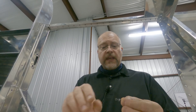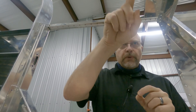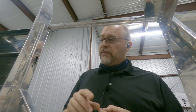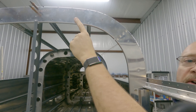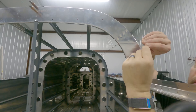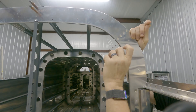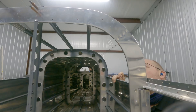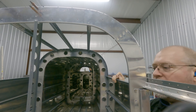That last little bit wasn't bad. I took these K1000-08 nut plates and put them in — there are four on one side and then one in the back. Those look great. Now it's a matter of doing the rest of the work, which is attaching the back. All these little holes you see each need a nut plate — I have to first attach the nut plate with a cleco, then match drill from the back. I also have to do the center piece. That's what I'm going to be working on now.